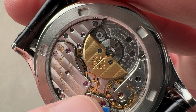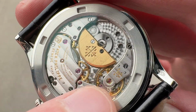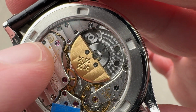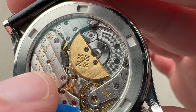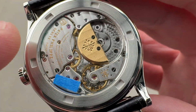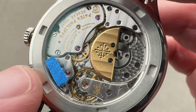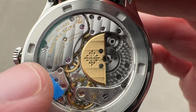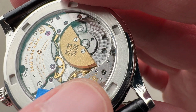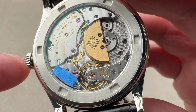It's a nicely executed movement. The bevels are undoubtedly started by mechanical means, but finished with a polish and a rounded mirrored shine, probably with some sort of drill tip that has a felt end for this kind of final pass, but it's something that Audemars Piguet, JLC and even F.P. Journe don't routinely do. The stripes are beautifully laid down by an abrasive wheel. You can see that all of the jewel countersinks feature beveling around the jewels, and then we've got engine turning on the base plate, and you can see that the locating pegs used to locate the balance cock, for example, those are polished on their head. So a lot of impressive execution here, and then satination on the wheels.